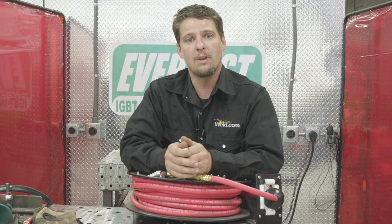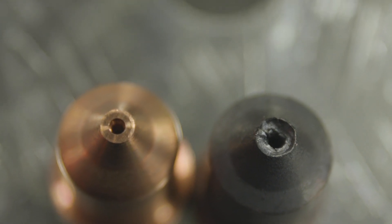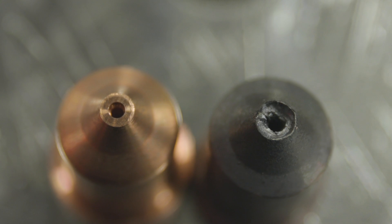Tip number three is to use a different air line for your plasma. A lot of people use an oiler system, which throws oil inside your air line and lubricates all your air tools because you've got needle bearings and everything. But if you're using the same line as that oil feeder, that oil is going to go inside your plasma. Even if you have a filter on your plasma, like this Everlast comes with one, it's still going to plug that filter up. When the filter is plugged up, it'll bypass because it needs air through the system. That oil goes through your lines and plasma torch and starts ruining your consumables. Oil combusts — it'll burn — and it'll start burning your nozzles even faster.